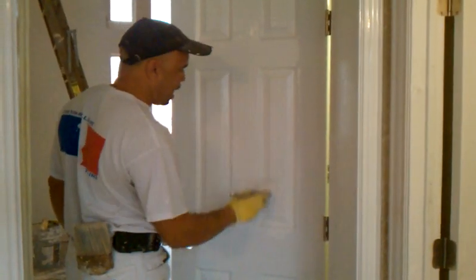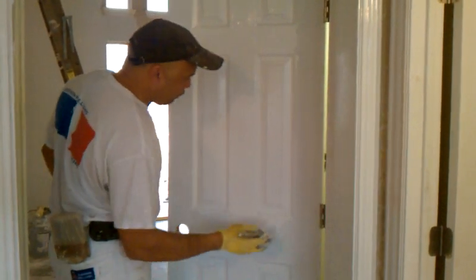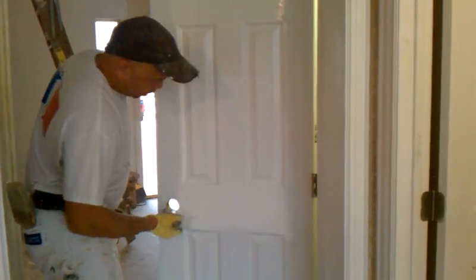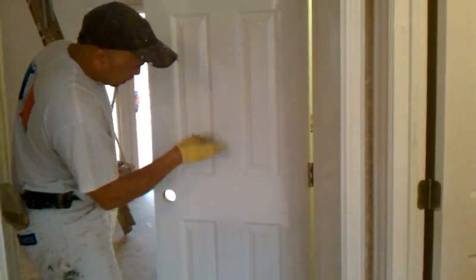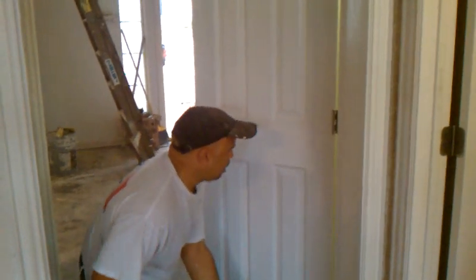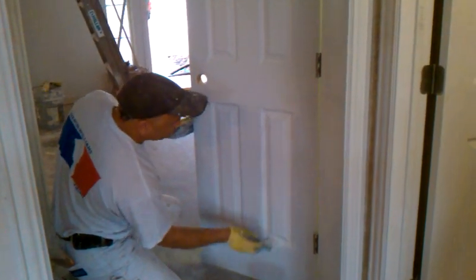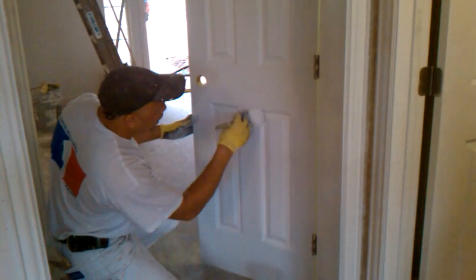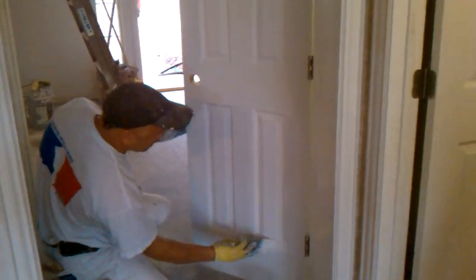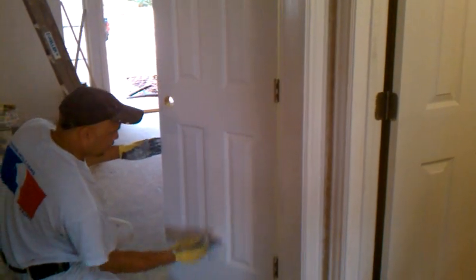These are just practical steps that you do when you're painting a door. You notice I brushed it all out, follow the pattern of the grain, and now I'm ready to move on to the next section. I'm almost down to the end — just keep going across. You have a little time. Notice I'm coming back here doing the same thing. Put that paint on there, just brush it in — four or five strokes. Then notice I brushed it all out and now I'm going to straighten it out, and then you just keep moving.